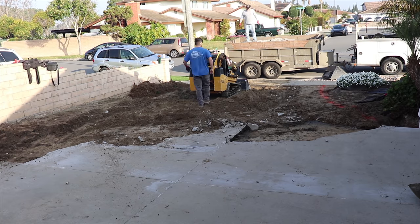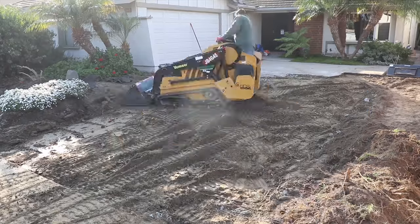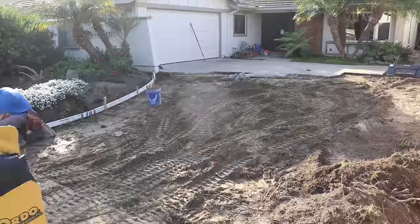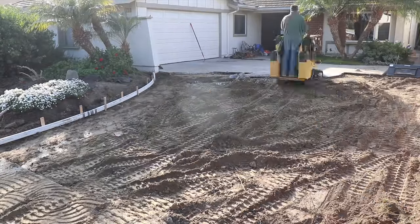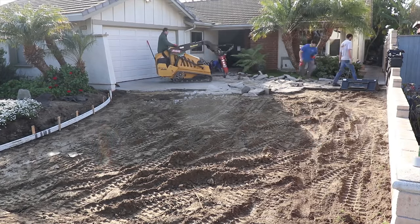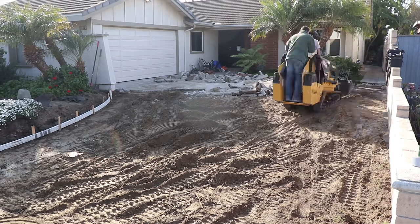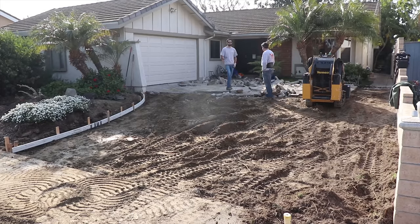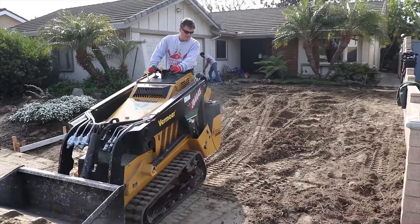You can see that concrete is three inches thick and it's coming out in big slabs and staying together. Concrete alone does pretty well without any reinforcement — you could do a ten by ten without any reinforcement and you'd be fine. You could sling it around with my tractor and it's not going to really break unless you drop it on the ground.